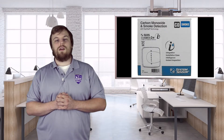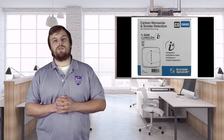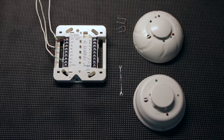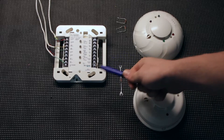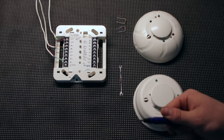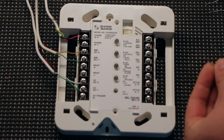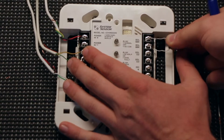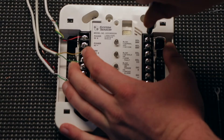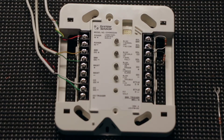Now that we have the module connected to the panel, I'm going to show you the two wire version of the module — how to connect a two wire Cosmo sensor and a 2WTAV smoke detector. After that we'll move on to the four wire. The first thing we need to do is hook up the end-of-line resistors to the module. On a Honeywell it's a 2K resistor, on a DSC it's 5.6K, and we're going to hook them into the EOL smoke and the CO EOL terminals. This tells the Cosmod what resistance to look for at the end of the line.